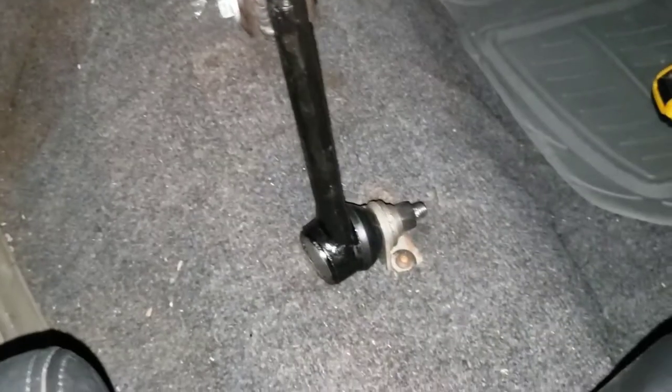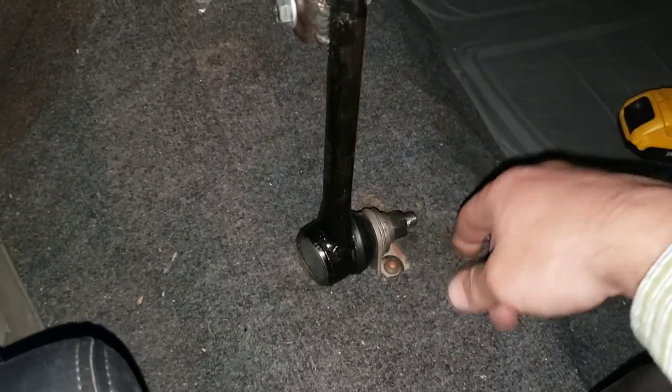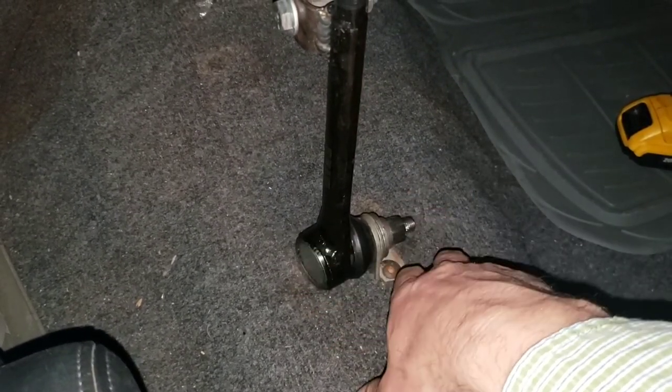There was some play, so when I would shift from left to right it would move just a little bit. But I found out it was more the sheet metal of the car doing it. So underneath I took a four-by-four square electrical box cover — a metal cover — drilled two holes, and just bolted it from the bottom, and it got rid of all that play.